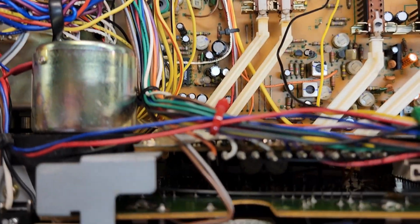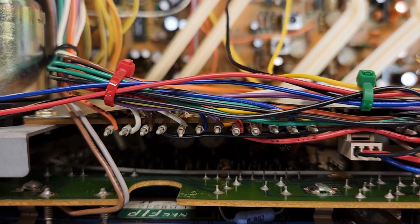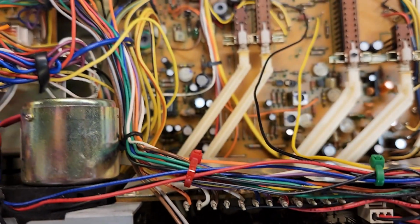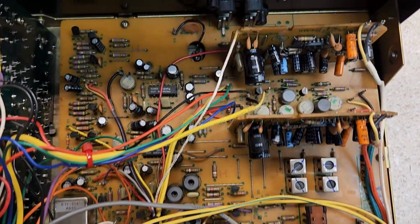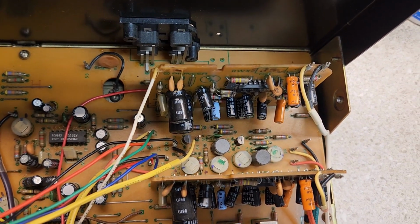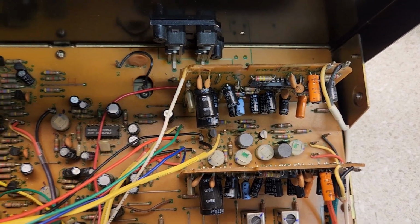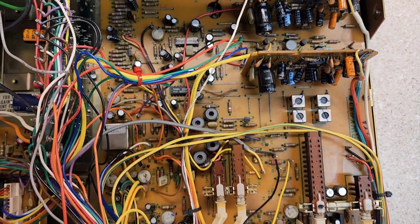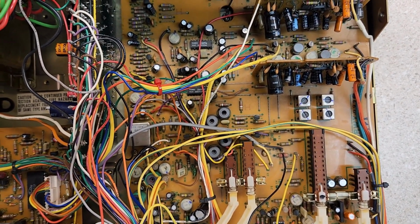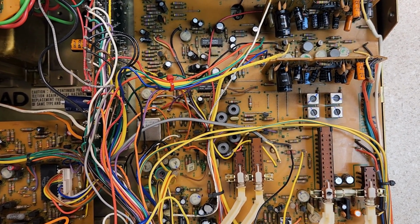And of course, the FL display board, that's this board back here, which is just a bear to take apart, was not recapped. Now, I have had units where I've recapped everything, including the two riser boards, which are your headphone amplifier and your mic amp. And I've done them all. This one doesn't need it. If that bothers you, don't buy the unit, right? But quite frankly, you're going to hear it in a minute. It just sounds like gangbusters.